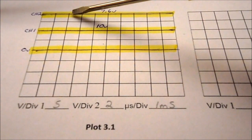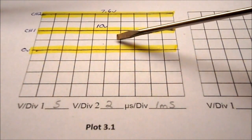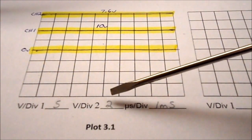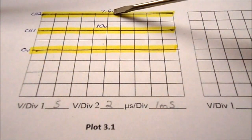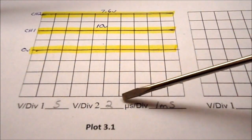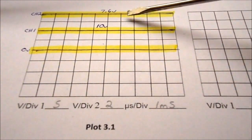I've drawn in my channel 2 line, and you can see it went up 3, not quite 4 divisions, 2 times 4 is 8. So I labeled it 7.6 volts. So when I come back later and look at this chart, I can understand what's going on.